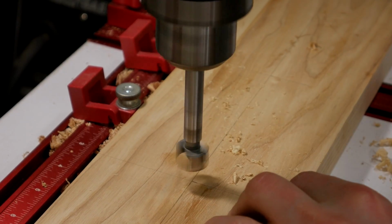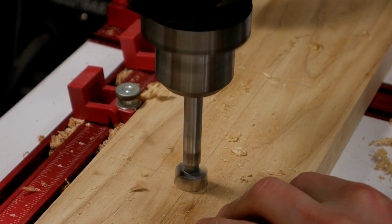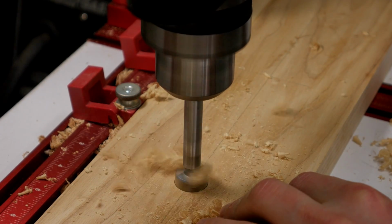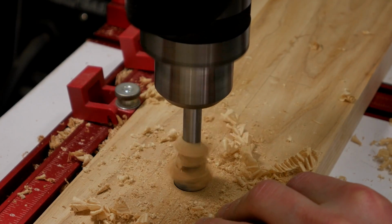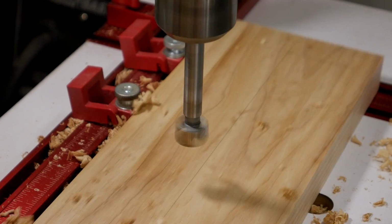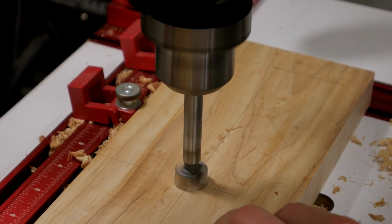While making space in the wall by the lathe, I realized I needed a way to mount a shelf support and an arm side by side. To accomplish this, I milled down some scrap ash to make a backer board. Here you can see I'm drilling some holes in the backer board for 1/4-inch lag bolts that will be used to secure it to the wall.